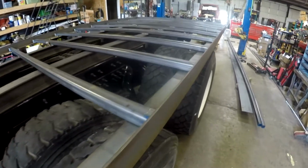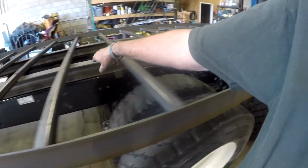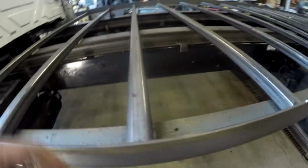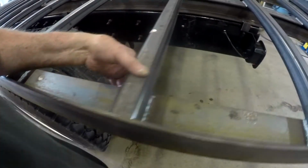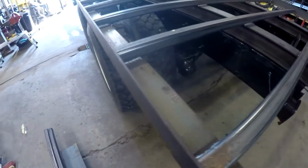See, what I've still got to do is bring the welder around on this side and weld out the back side of all of these tubes onto the I-beam, and the same way with the tubes that are on here. Every other one is not welded, so what I do is go through with a C-clamp, clamp them down so that they're good and tight, and then weld them out. But anyways, just coming along.